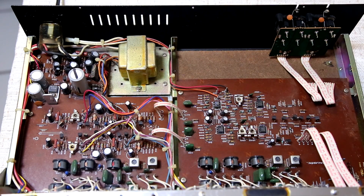This is the 31-2000 with the cover removed. I wanted you to see the technology they were using back in 1981, as well as point out the problem capacitor — C111 right here. I also replaced the equivalent on the right channel, C112, even though it tested good. They laid this out nice to work on — this would all be your left channel, and here's all your right channel. I also replaced C101 and C102 as preventive measures, although they both tested good.